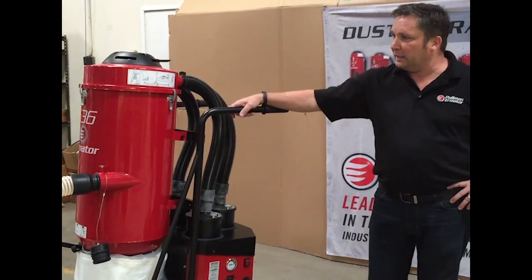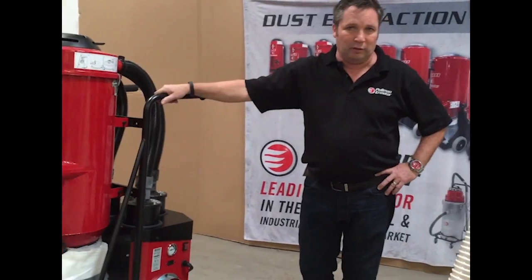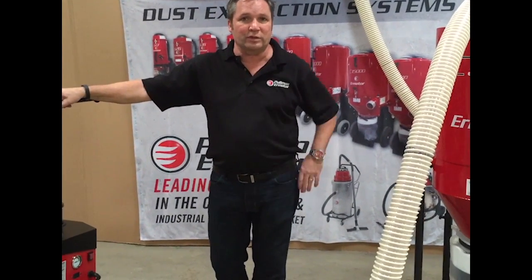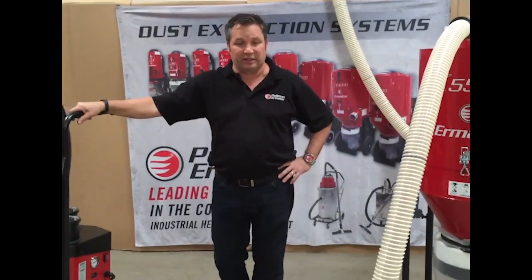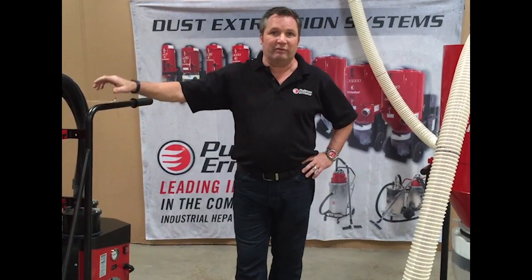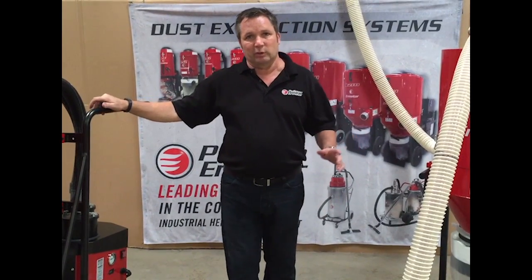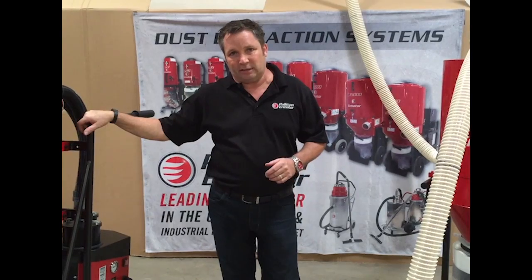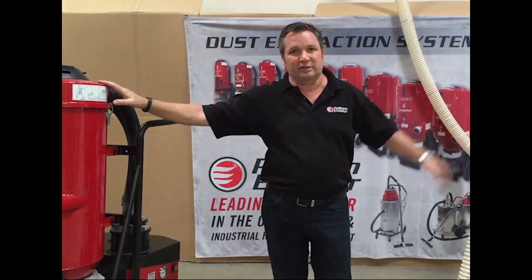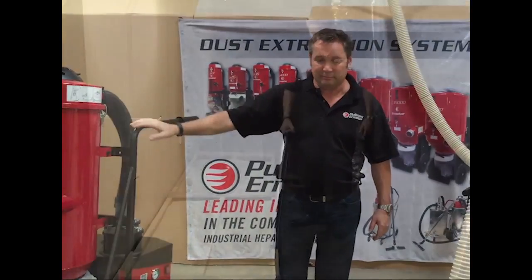So what we're looking at today is the application of vermiculite removal. Vermiculite was put in thousands of homes and it carried asbestos in it. Now when that vermiculite needs to be removed, you have to have HEPA filtration and total containment. So what we're going to show is a little bit today about how quickly we can get it out of the attic and go through the pre-separator and into the S36. So let's go upstairs and take a look.